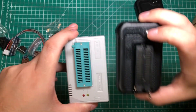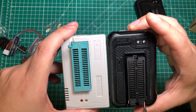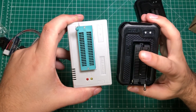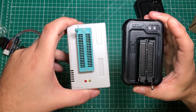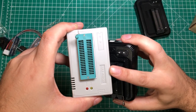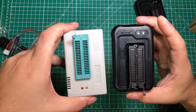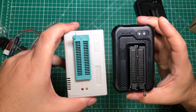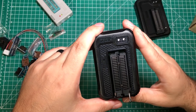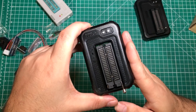That's where the T48 comes in. Not only is it faster, but it has the ability to put out the full 25 volts needed to program 99.9999% of the EPROMs on the market, including the ultra old ones. The TL866 can do 17,000 chips, while the T48 can do 31,000 chips. The T48 can also do things like program eMMCs and other functions you just can't do with the old TL866 2 Plus.